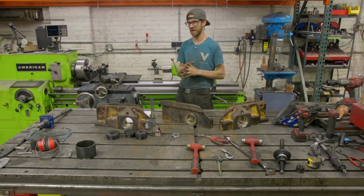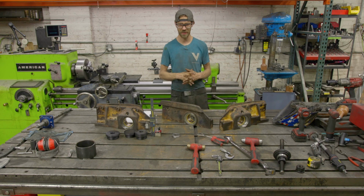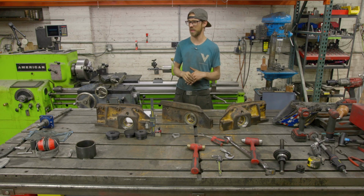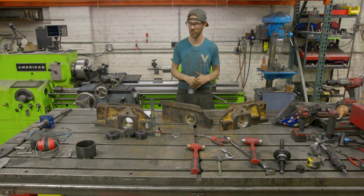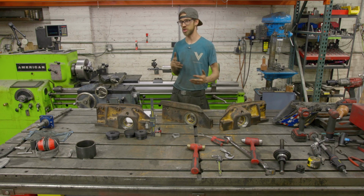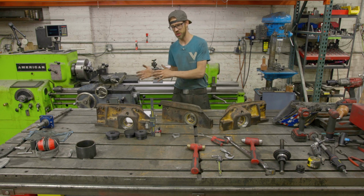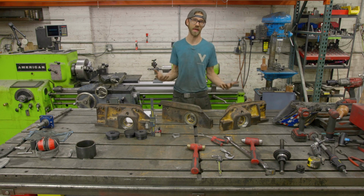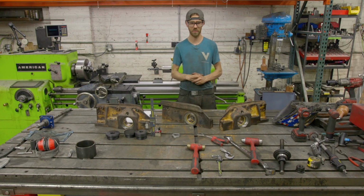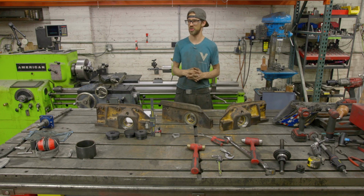And so that's something that I don't love about that machine, using it like this. It's not the intended purpose for that machine, but it does do it. And if you look at a lot of the radial drill catalogs back in the day, they show boring setups. Some of these came with a lower range feed box, and depending on how you set it up, you certainly can do it. We did do this job, but my drill just really isn't set up super well for it.